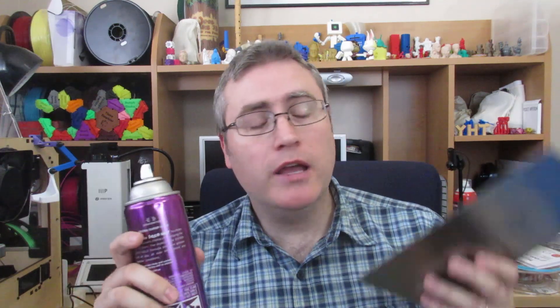There's the old standby of Aquanet Ultra Hold Hairspray on glass. The reason why this works so well is because there's good heat transference between the glass and the build plate. The Aquanet, if you put a nice thick layer on there, becomes really sticky during printing if you have a heated build plate. And then after printing, it kind of re-solidifies and the print literally pops itself right off. Again, you have to reapply this over and over again. Glass isn't really important — I've done it on bare metal, I've used hairspray on top of other build surfaces. This is one of my original GeckoTech build plates — they have some cool polymer on there. The GeckoTech did great, but ABS stuck to it a little bit too much, PET not as well. There were other polymers I just couldn't get off without sanding it down and destroying the build plate. In the end, the GeckoTech holds onto the hairspray pretty good, so I just reapply it.